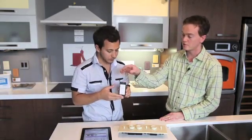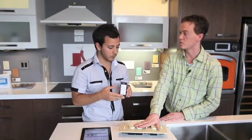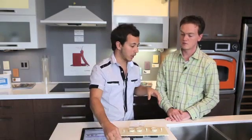So you can create a scene, a mood, however you program it. And there's no wiring between this device and the bank of switches — it's all wireless. It's just wireless Lutron RF. You're feeding your power to that bank, and this is why it talks wirelessly. So how's it talking wirelessly? Let's talk about the actual system package.